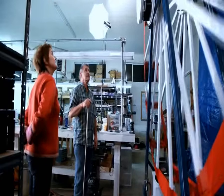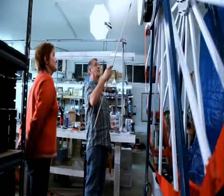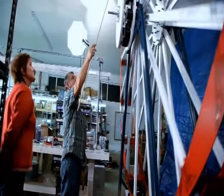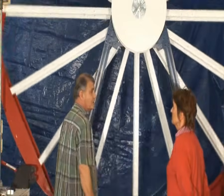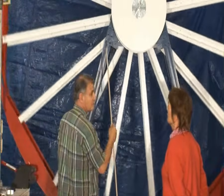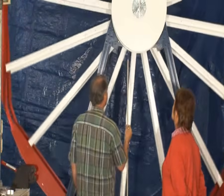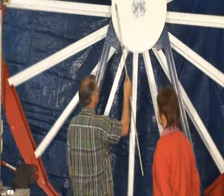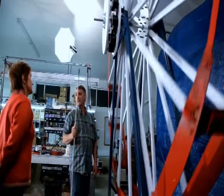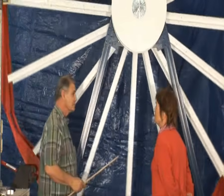Yes. And also, when I start the motor, this is the motor force at this speed. Anything over this speed, this motor will be off and become a generator. Because it has the north and south poles all the way around, and it has 10 poles. And each one of these coils has 2,206 turns.